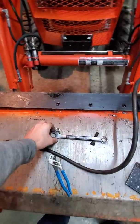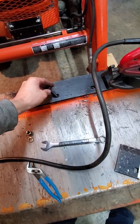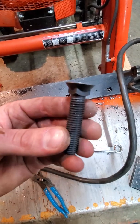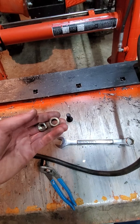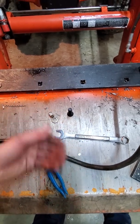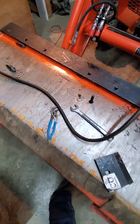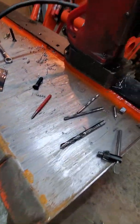And you gotta use 1/2 inch bolts if you decide to get this bar. They're the plow bolts. And I'm gonna end up just using a lock washer and a regular 1/2-13 nut. And I'll cut them to length so they're real low profile on the front side of the bucket when I'm done. I just thought I'd give a little video on how to.